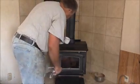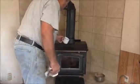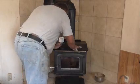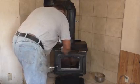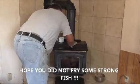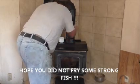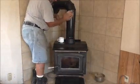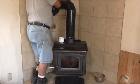And this, you can see, is pretty dusty. And what I did was I have some used cooking oil. And I always clean my stove with a rag and some used cooking oil. And you say, oh, why would you do that? Well, because metal, especially when it gets heated, has to be treated. And the old timers did it this way. And try getting in here without falling down. You wipe it down, and you wipe, and it keeps it from rusting.